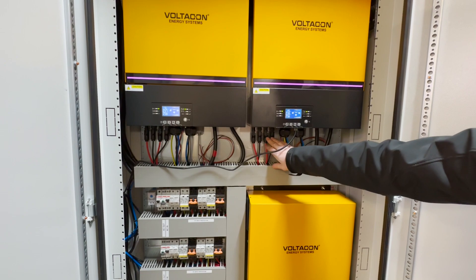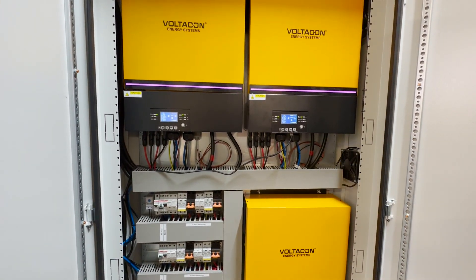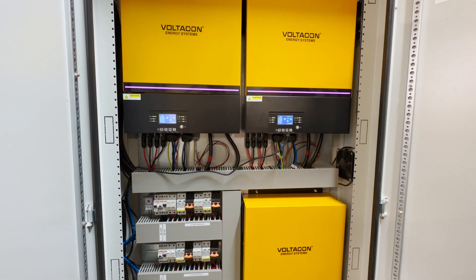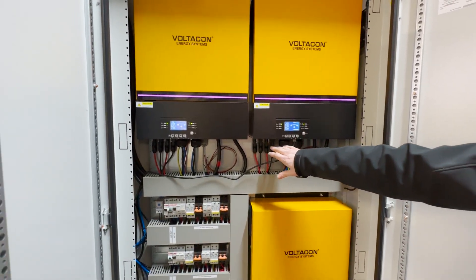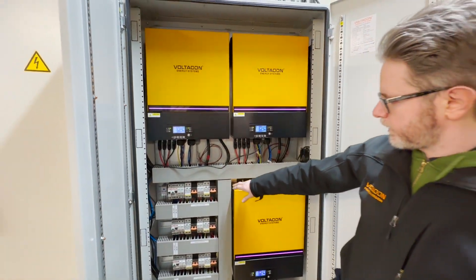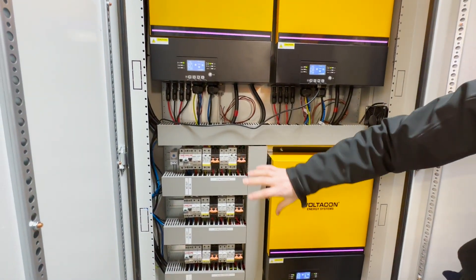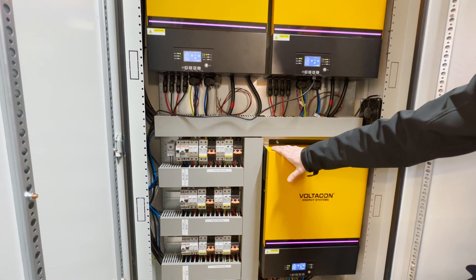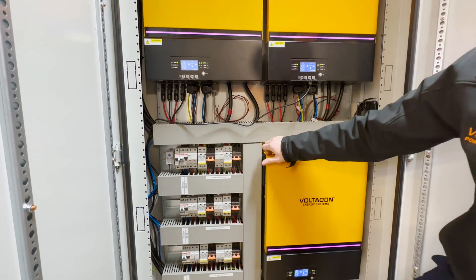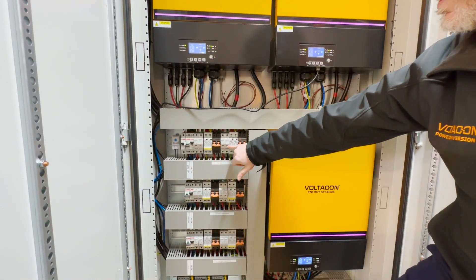From solar panels we have six MPPT controllers in total from PV1 and another six from the other side for PV2. We created — let's call them combiner boxes — but they are integrated inside the silent power cabinet. They have surge protection, DC breakers, and fuses with LED indicators.